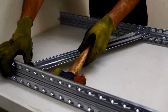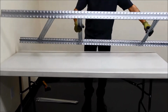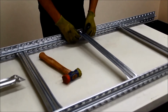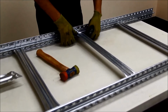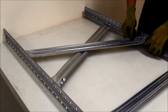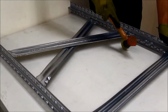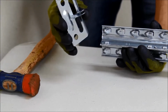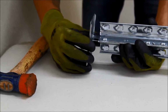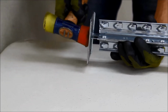Be sure to apply the diagonal spacers to the bottom. Flip the frame over to insert the final horizontal and diagonal spacers. Then, put the steel base plate onto the bottom of the post, using your hand to guide the two tongues of the plate into the nibs of the upright. Then hammer the base plates into the nibs with the rubber mallet.